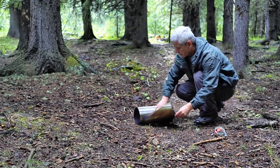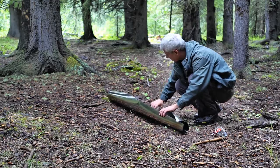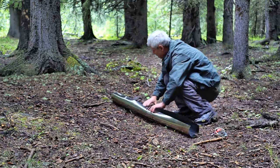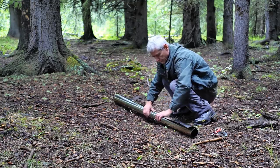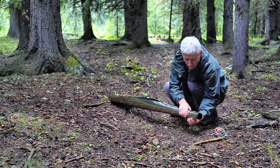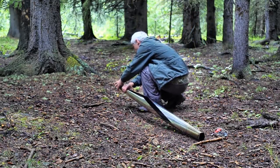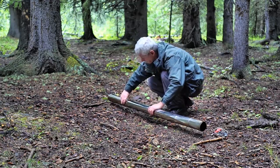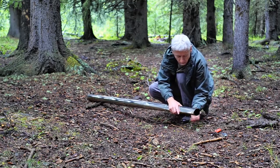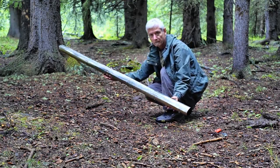Here's how you use it: first remove the clips and unroll the titanium film across the ground. After the first time you use it, the heat forms the shape of the stove pipe and the metal remembers that shape, making it easy to form a long cylinder without denting the delicate foil. The rest is just the process of rolling it small enough to get the clips on, spacing them evenly along the length of the pipe. Titanium forms a protective barrier around itself to prevent corrosion, the folded edge makes a great seal from smoke, and titanium distributes heat well — it's really the perfect material for a portable stove.